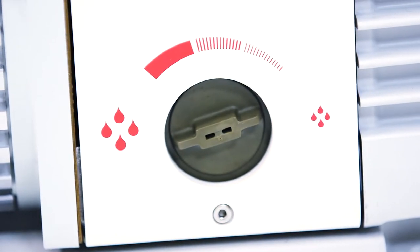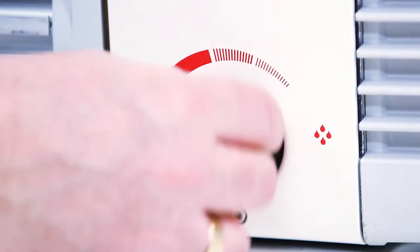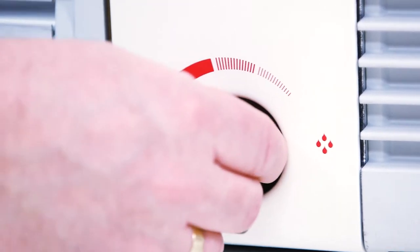The RV pump is an extremely versatile unit with a unique mode switch which can be set to high vacuum mode or high throughput mode. In high throughput mode, more oil is fed directly into the high vacuum stage, which is advantageous when using the pumps continuously at higher inlet pressures. For best ultimate performance, the high vacuum mode is selected. This is the default setting; in this case, oil is degassed before being fed into the high vacuum stage.